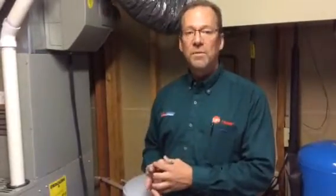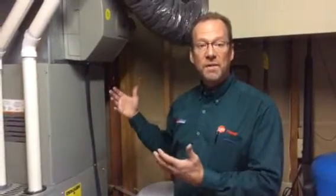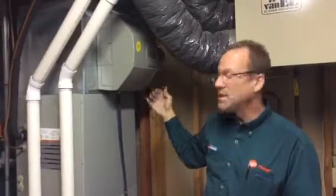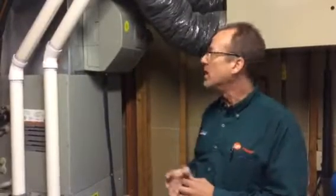Sometimes people didn't like humidifiers because of the way they used to be designed. If you had one in the past, you might have had a bad experience. Well, those things have been taken care of, and I'll show you why. The old ones had stagnant water sitting in them, scale and mold and things could develop, and that's what you're humidifying the house with. Now, fresh water is always coming in on the top. When it's finished, it shuts down, and any excess drains right out. So you always have fresh water and don't have problems with bacteria in the water.